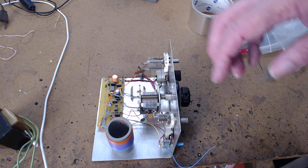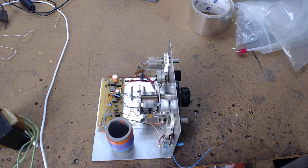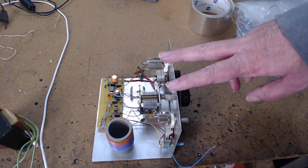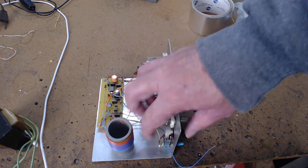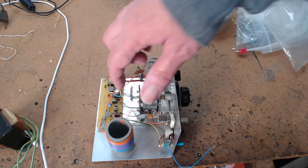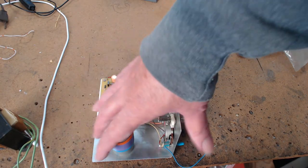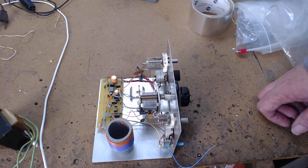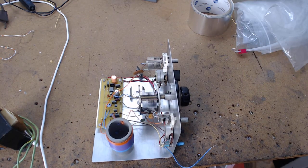You basically have the wrong headphones for a single transistor circuit or a single tube, or your winding needs the wires to be reversed on the tickler. It's called a tickler coil. It creates feedback like the microphone and the audio amp. Okay? And if you got it reversed, it won't oscillate.